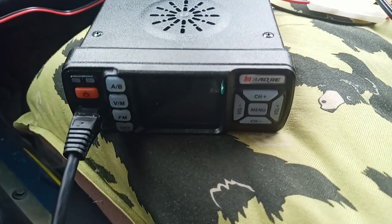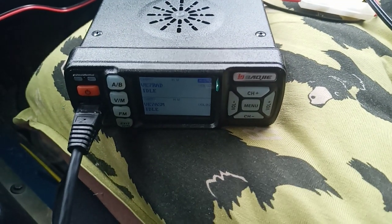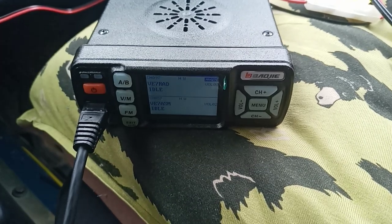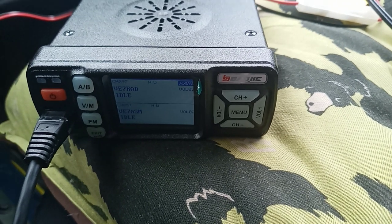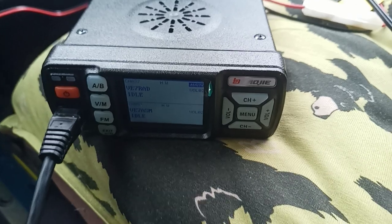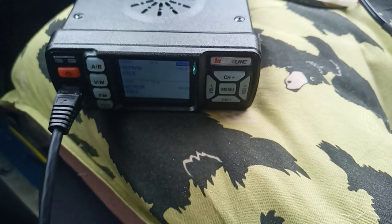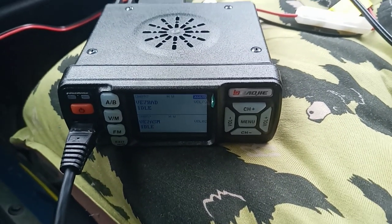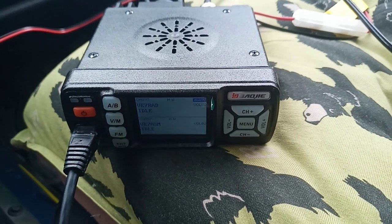Some of the other issues you'll have: you could be scanning, or maybe you're listening on a channel — maybe you're using it to listen for logging trucks or something like that. The other thing that will happen is it'll just stop receiving even if there's a signal being transmitted. You won't hear it, and there won't be any indication. Actually, it will look like it's receiving but you'll hear no noise and it'll just be frozen like that. You're probably not going to notice that, and if you're relying on it for safety, you definitely can't count on it. You have to reboot the radio whenever that happens.